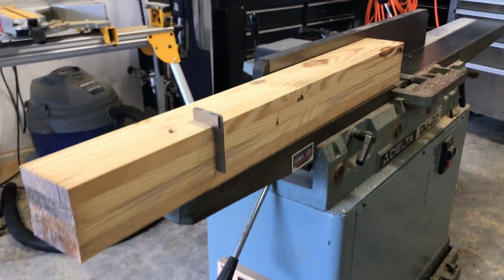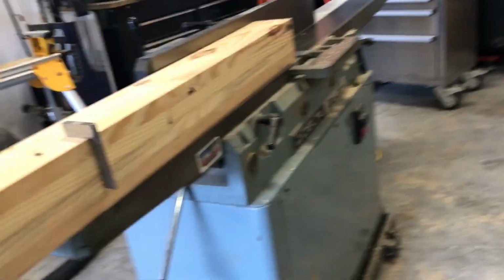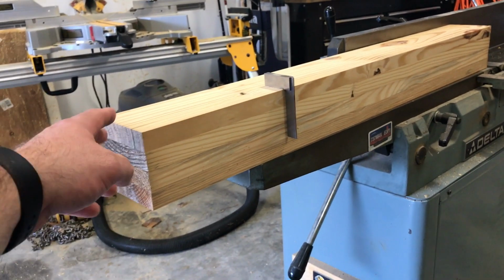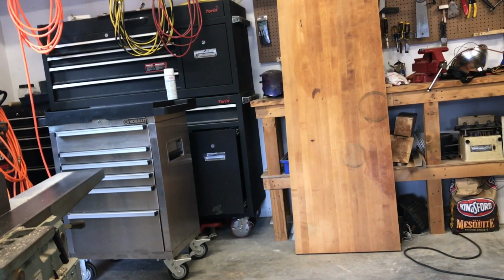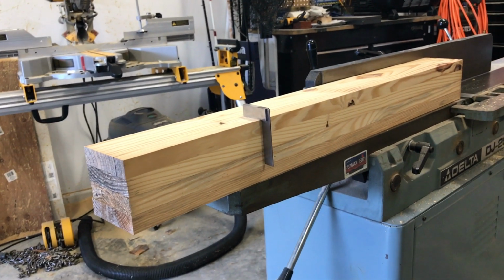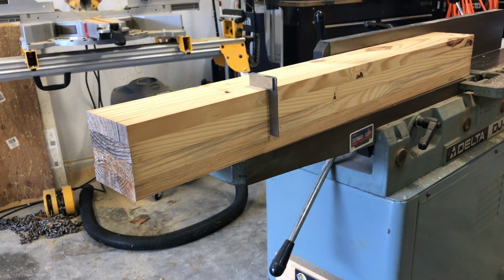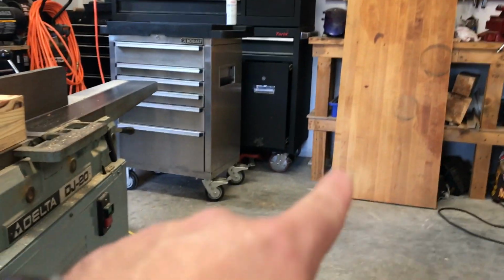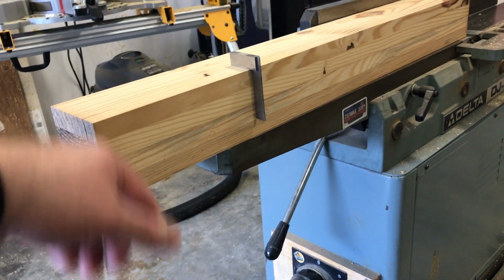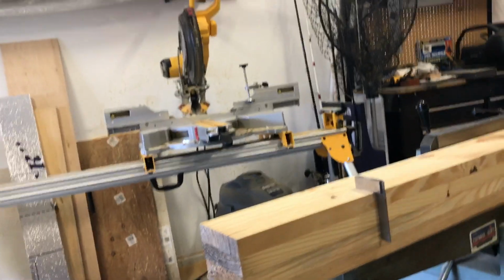So now what I'm gonna do is cut these to 26.5 inches. I get another 1.5 inches on that top that I'm gonna use there. Basically, I'm gonna sit this cut edge directly against the bottom of that tabletop surface. The reason I'm cutting them 26.5 is because I measured a couple other desks, and the top surface was exactly 28 inches, and so it seems like a good height. So if I subtract 1.5 for that guy, 26.5 for these legs, that'll put the top surface right at 28 inches. I'm gonna use a chop saw.